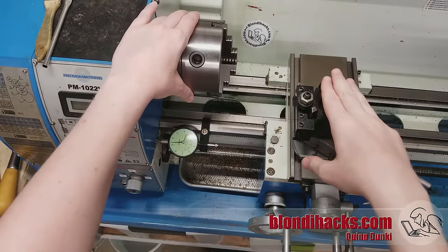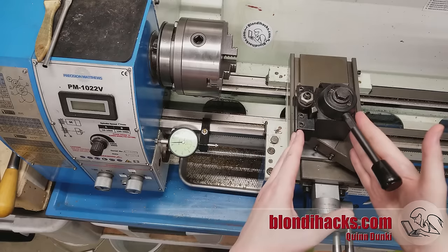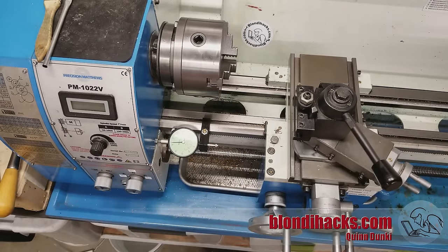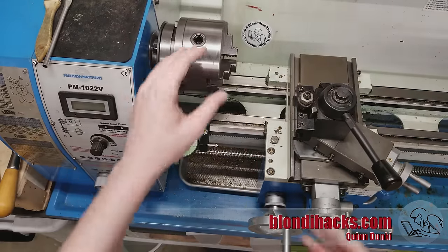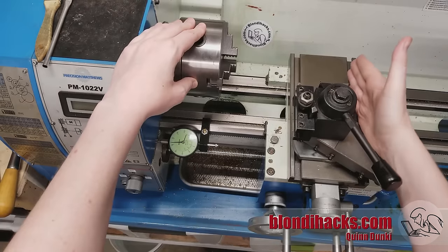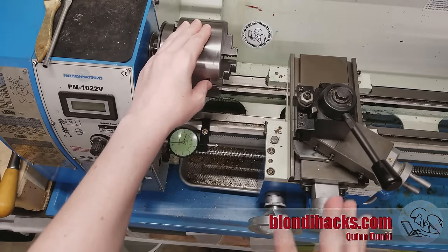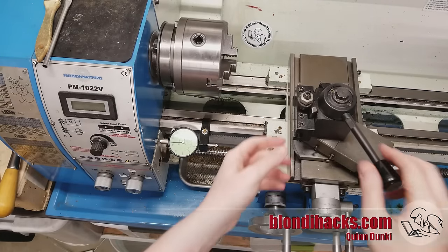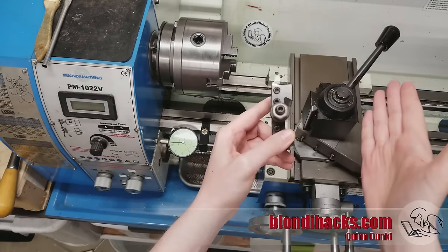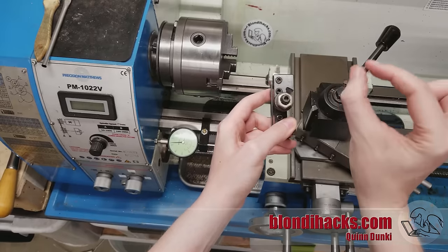Here's our work envelope. The core principle of a lathe, of course, is that it spins the material and the cutting tools remain stationary. The value of that is that it minimizes the amount of motion required of the tool relative to the part, giving you flexibility within the work envelope. A machine tool's job is essentially to hold the work square relative to the tool and allow you to move that tool square. The ways, the chuck, and the cross slide are all square to each other so that when you make cuts you know they are square. Lathes use what's known as a single-point cutting tool, meaning the cutting is done by a tiny point on the end of the cutting tool, and the tool must move all the way across the surface because it's only cutting in a tiny area at a time.